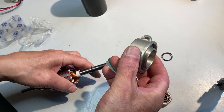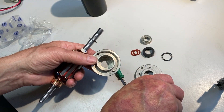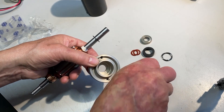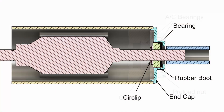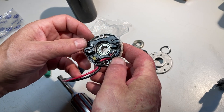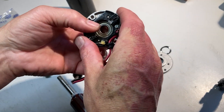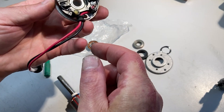I've machined up the housing for that. The two bearings will go in either side of the circlip, be clamped shut, and that will bolt into the original motor housing. I've also reworked the brushes to try and make sure you have better contact with the commutator. The rear bearing is also rubber mounted in the same way as the front one — I'm not intending to do anything with that for now, but maybe one day I'll make a new back plate.